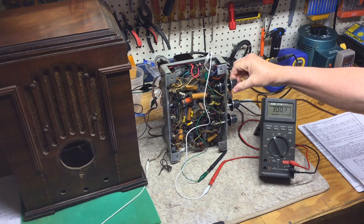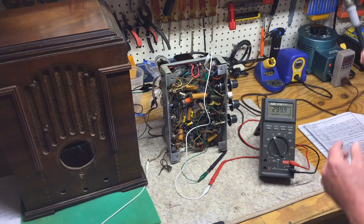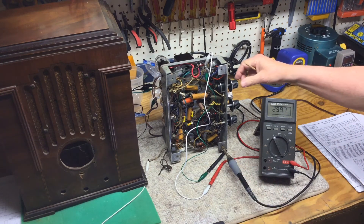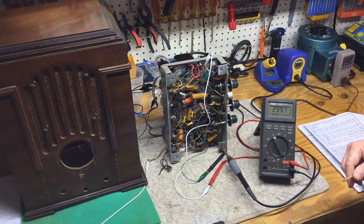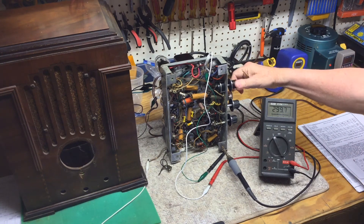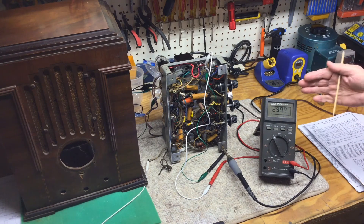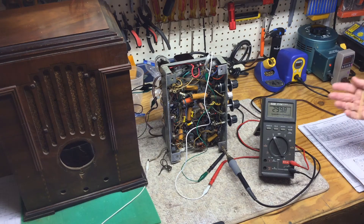I'm probably not going to go any higher than that. I would expect this radio to draw somewhere around half an amp of current or a little bit more based on the tube complement — I'm at 0.45 amps right now. This chassis is not grounded. I'm going to use my soldering iron here to see if I can quiet down some of the noise, which I can't. So that's probably just a capacitor or resistor that's creating a lot of this noise or racket. I'm going to turn the volume up. I'm at 0.45 amps of current and just right at 300 volts DC.